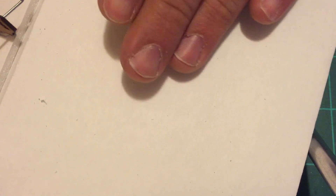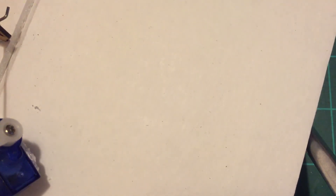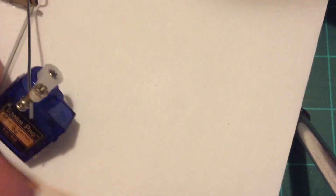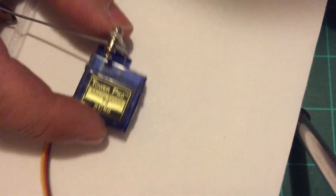If you have a plane that's got a lot of force on the ailerons, or takes a lot of bumps and bangs, that paper will come up and you'll notice you're not getting full throw because the paper lifts in one direction or the other, or you end up with a really bad flutter — which has happened to me before with a wing that completely disintegrated in the air and destroyed a battery pack and a motor. You might even consider reinforcing that area by embedding a piece of a gift card or a piece of plywood if you want to go a little bit heavier.